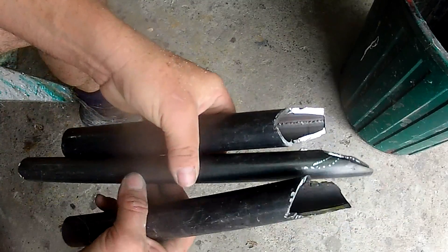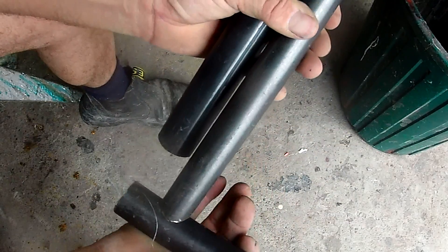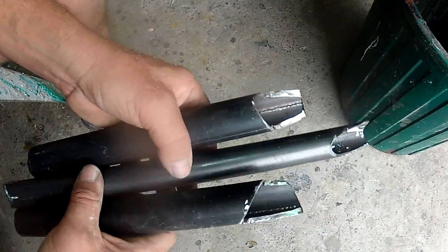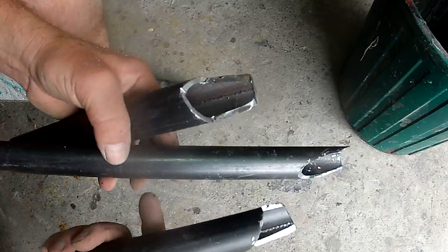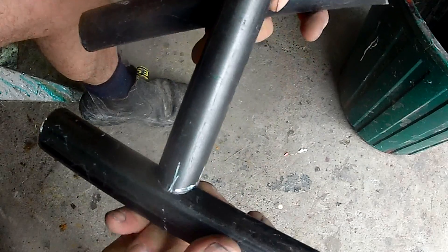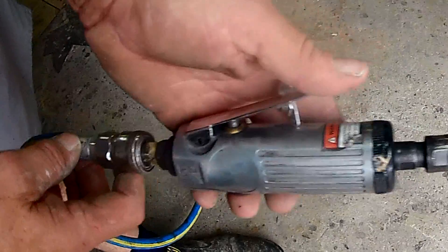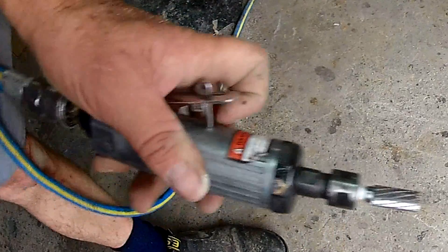Don't expect that you'll cut every piece of steel tubing at both ends perfectly every time - you're going to have failures. I think you'll minimize them if you cut your pipe over length, cut the most difficult end or angle first, and just accept that you'll sometimes have to cut things two or three times to get them to fit. The advantage of getting your joints well made before you weld is that your welding - whether you or somebody else is doing it - will be much easier and much stronger. Get yourself one of these for finishing off the cutting of your joints: an air tool with a round grinding bit. Can't live without this.